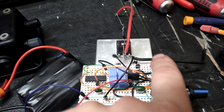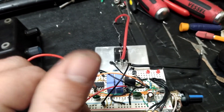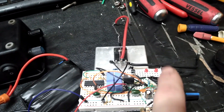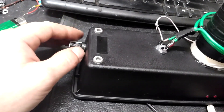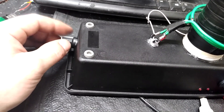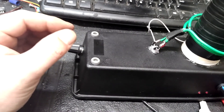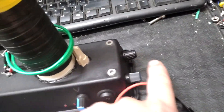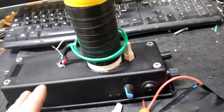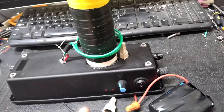There's a signal transistor on there that switches one LED showing the PWM and frequency, and the other LED just shows power coming from the 12-volt regulator. The trim on the actual circuit determines the switching level — depending on what it's set at, you can raise or lower the point at which the capacitor pops. The boost driver voltage, combined with frequency and duty cycle, means you can get pretty much any kind of power input and output you'd want, given what the circuit is capable of.